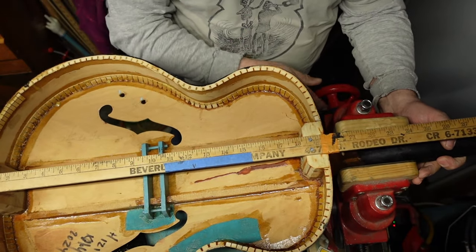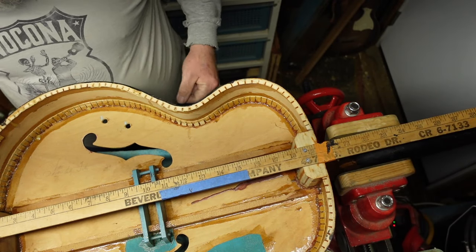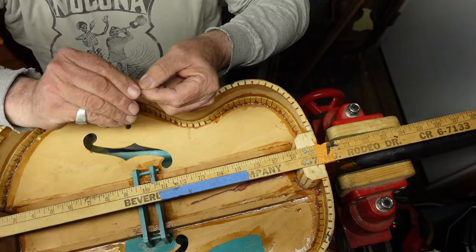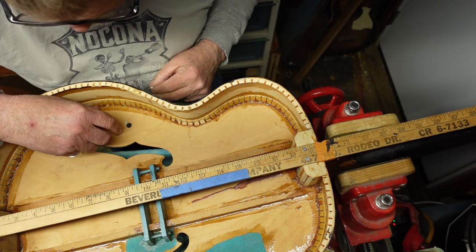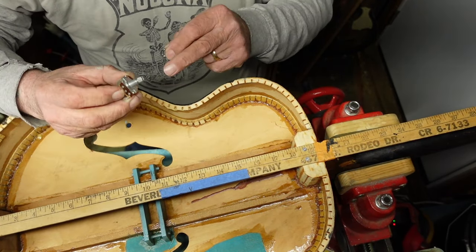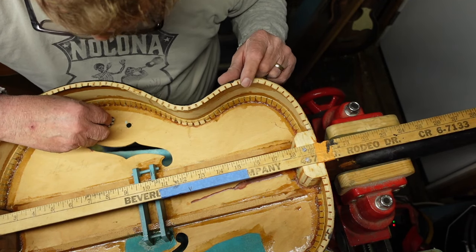Notice I have that bean bag underneath there. How we doing? There we go. We can see it. So I'm just going to get rid of those burrs like this. Bingo. I'll tell you what, I like these tooth washers because they stop things from spinning once things are in here. Now, I want you to notice that some potentiometers have a little lug that sticks up, so you drill a little hole and then you put it in. If that's going to be the application here, you push that lug down. But anyway, you just put that there and it will stop everything from spinning.